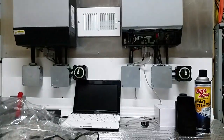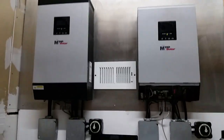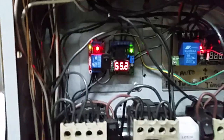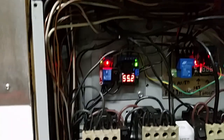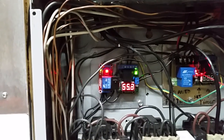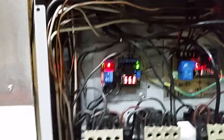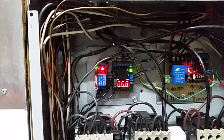That way I'm always able to maintain the rest of the house — refrigeration, the complete house minus the wall unit — on the grid after 5:30. Then anytime the batteries are above 80%, this voltage control switch kicks in. You can see the green light is on and engaged, so the air conditioning is now running on the inverters. You have full control of the voltage parameters for when it comes on and off, so you don't go too deep into the batteries.